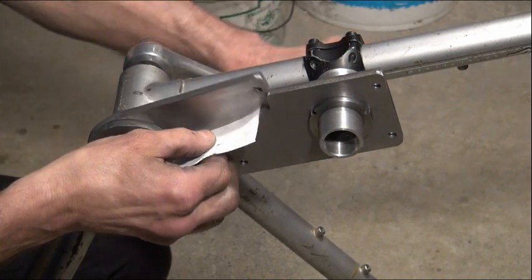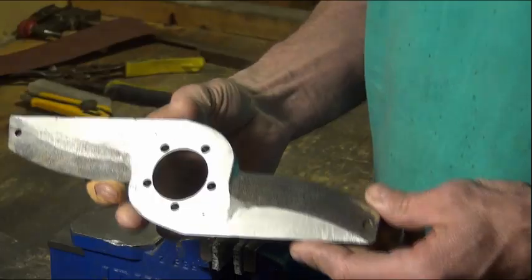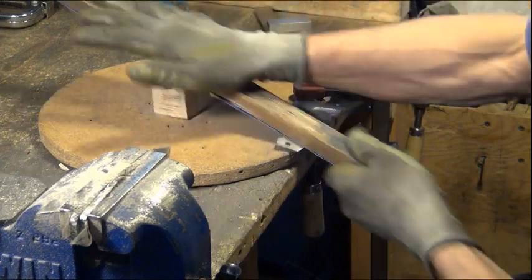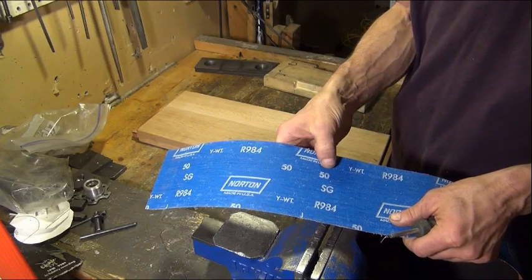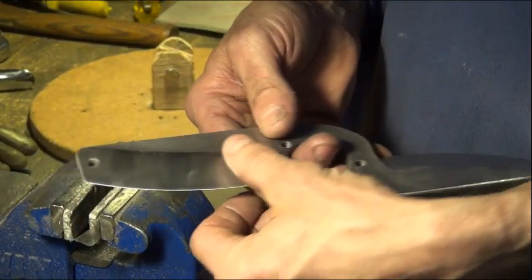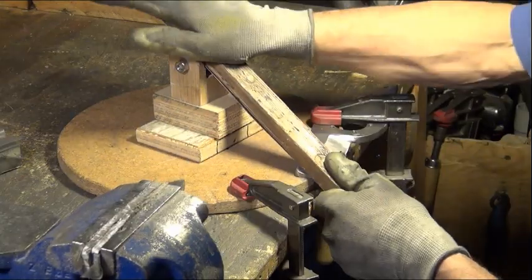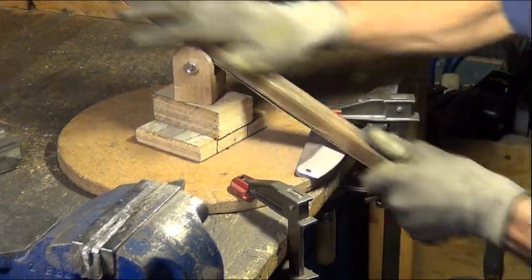But to be more than scissors and more like a knife, I needed to give them a bevel — more of a wedge shape. I hacked, ground, filed, and finally sanded it flat using a beveling jig that I built that sets the primary bevel at 20 degrees. I went through a gradation of different sandpaper grits to get a smooth finish on the primary bevel. Then I needed to give it a secondary bevel: after polishing, I raised the jig and put a 35-degree secondary bevel on the edge of the blade to make it tougher and longer wearing.